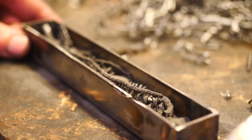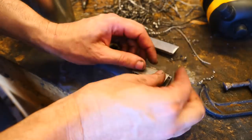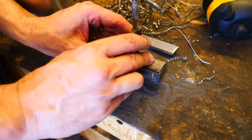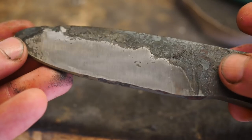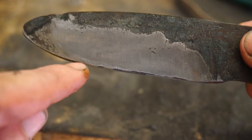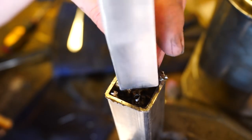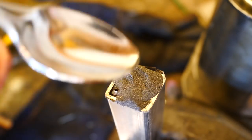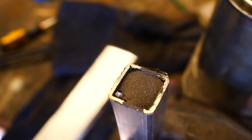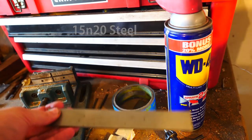Now if you watched the first drill shaving video, you remember I tried to lay out the spirals lengthwise in a canoe-style canister so that they ran down the entire length of the blade. But despite my efforts, not really enough of them were visible in the final knife. So we ended up cramming them into the canister in a vertical manner, and the resulting knife was interesting but it wasn't what I intended.